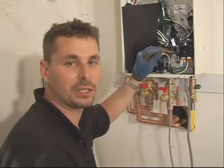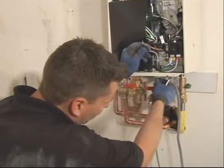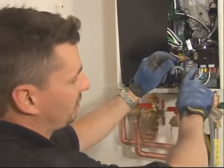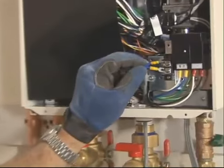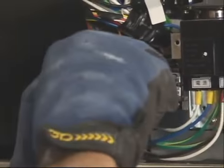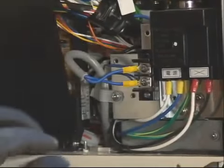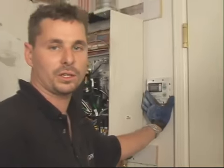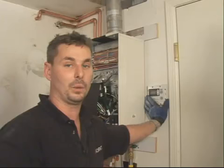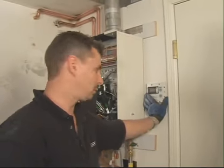The 6.9 series includes a thermostatic remote, which is tethered by this cord right here. It goes up through the port on the bottom of it, is secured to this so that you don't pull the cord out, and is attached to these two terminals right here. It has no polarity, so just make sure that you hook it up firmly to each port. In this installation, we're installing the thermostatic control right next to the Noritz unit. It can be installed up to 300 feet away from the Noritz unit in a dry location by using 18 gauge bell wire.